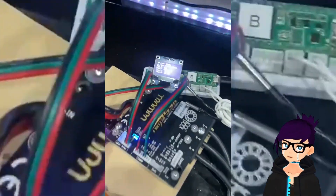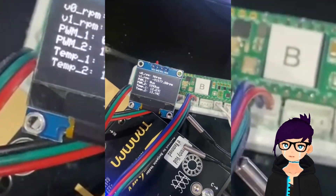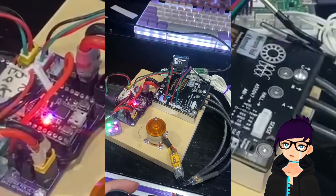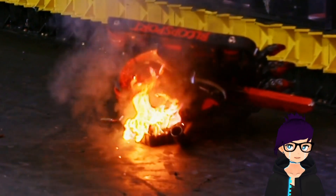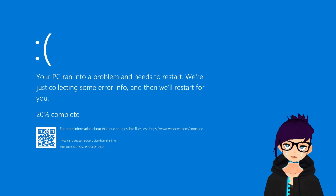The telemetry modules are capable of collecting this information, recording it into an internal SD card, and broadcasting the data wirelessly outside of the robot. We wanted to have multiple ways to record the data in case the SD card inside the robot was destroyed during the fight, or in case too much wireless interference or another malfunction prevented reading the data from outside the box.